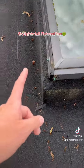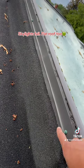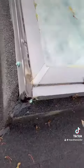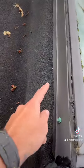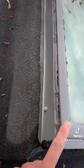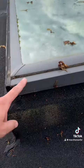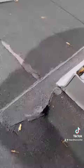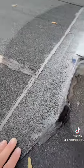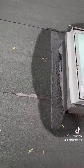First off, we got a deck mount skylight mounted to a curb with the old flashing kit somehow modified. I don't even know, because they're missing the actual cladding that goes around the top of the frame. I'm thinking they flattened it, cut it up, and then tried to lap it, and then they were like, oh jeepers, it's gonna leak — so some caulking. They have the piece of cladding in the front but it's missing on both sides. Love the color choice and screws. Never peeled the sticker. It's caulked all the way around. This is a brand new roof. How many of you would have flashed the curb and then done your top sheet? Or would you have done it like this?